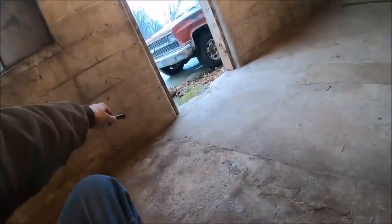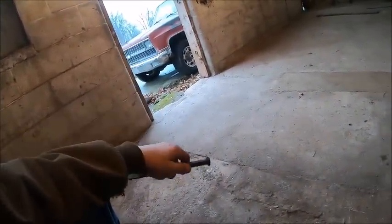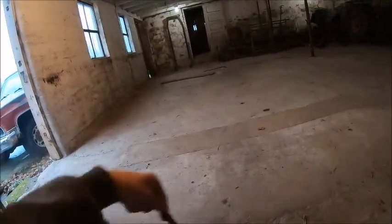But I got my corners laid out. There's going to be one here, one there. I'm coming back 5 foot off the wall. And like I say, we're coming in one full block from the edge of the door. Don't want to come in too far, because then you got slope where you're trying to park stuff, which isn't good. But you don't want to go too far out, and then you got a really steep ramp that's a pain in the ass to get up and down. And this right here just seems a fairly happy medium, because that should give you about 25 foot of flat here, and then the rest of the floor.